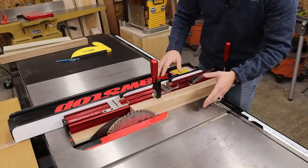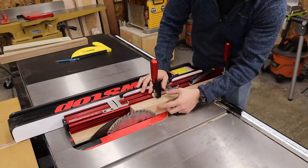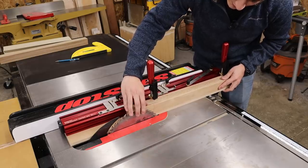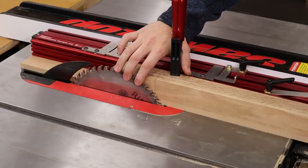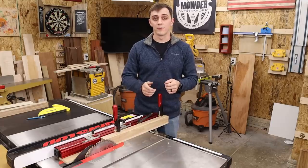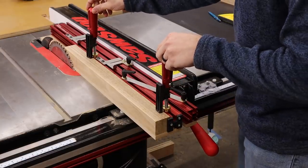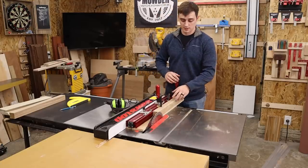Now that my sled is trimmed down, I've reset my taper jig to one degree and I have my starting line where I want my taper to start. I've slid my fence over just enough so that when I push it up, that line just kisses the blade — you can kind of hear the scraping of the saw blade against the wood. Before we make our first cut, make sure your stock is pushed all the way up against the push plate and that the clamping blocks are tightly securing your workpiece. With the Precision Taper Jig all dialed in, I'm going to make my first cut of this two-sided taper.